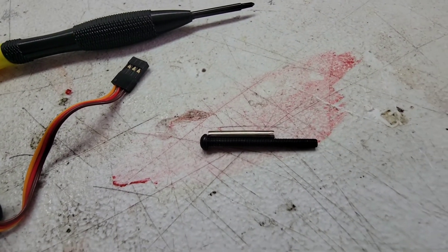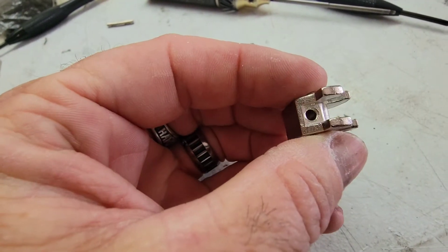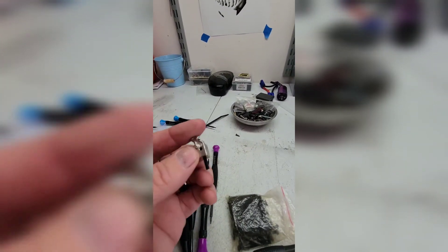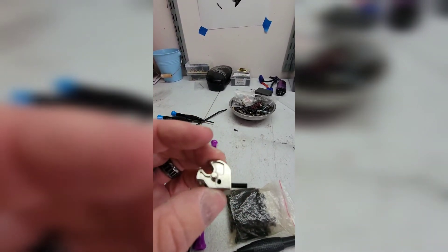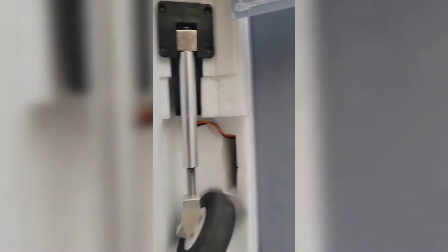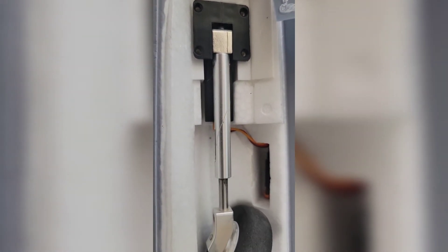There's the bolt — I'll measure to cut it right there and just use my Dremel to cut the end of that bolt off. Then it fits perfectly through the hole, and with the head on it, it fits in there without causing any problems — you slide it right through. You don't worry about flat spots because the threads on the bolt collapse like a flat spot when you tighten the set screws down, locking it in place. I used the same set screws, set it back where it goes, and tightened it down — ten times stronger than that aluminum.